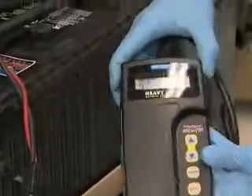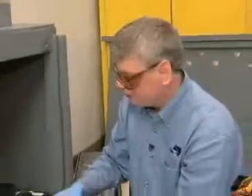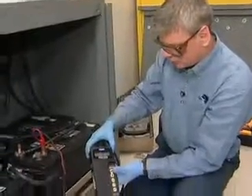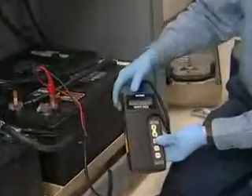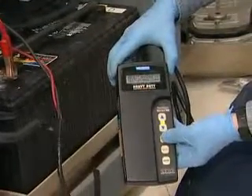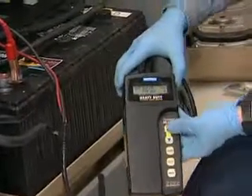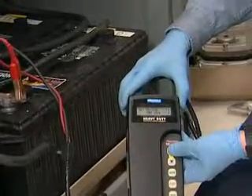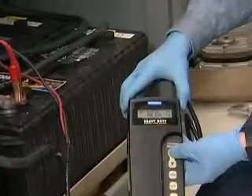Select the rating of this battery. This battery, according to the information sheet on top of it, is rated at 1,000 cold cranking amps. So we're going to hit enter because we want to use CCA, or cold cranking amps, as our test. It's sitting at 770 right now — that's not good enough. We want it at 1,000, so keep pressing the up button until you hit 1,000.